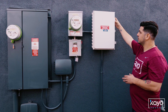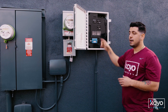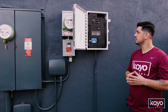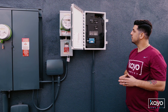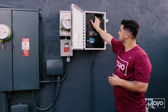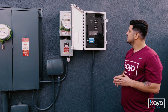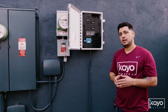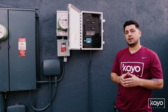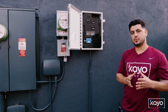The final box is your AC combiner. Inside, you'll find a varying amount of breakers depending on your system size. Start in the center at the 10 amp breaker labeled Envoy, then turn on the remaining breakers. Once this is done, in the top right-hand side you'll notice four flashing red lights. This means your system is activated and is going through checks and balances to make sure that it is safe to produce power.